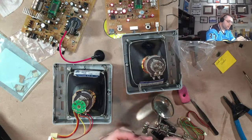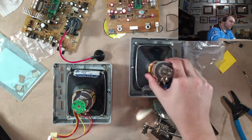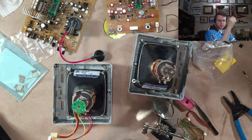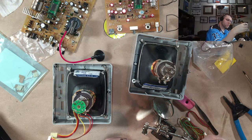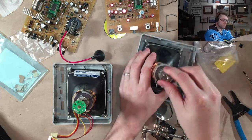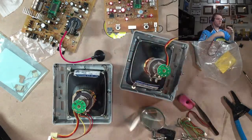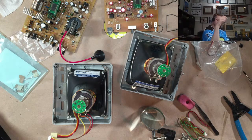So I thought about that, right? And I actually might end up doing that. I have the screw somewhere, and the post broke in half, right? So the screw's on the top. What I might do is super glue and baking soda. That's worked very, very well for me. Because the baking soda reacts quickly with the super glue, and it forms a really strong bond, and you can actually build up decent gaps by just adding a little bit of baking soda and super glue back and forth.